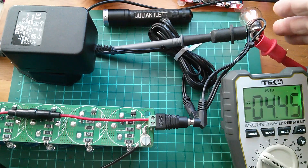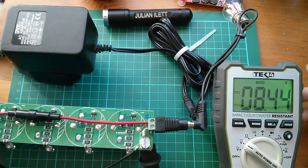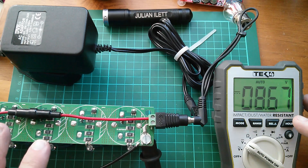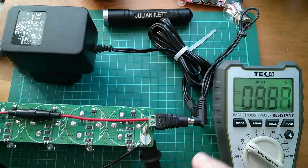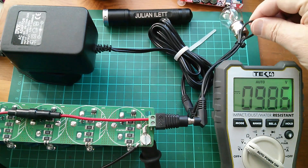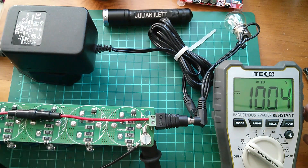After some difficulty attaching my meter probes to the bulb, we can see the bulb voltage is about five volts and falling. So the voltage across the bulb will fall. As that filament cools down, its resistance will get lower, so there'll be a better path for current to flow into the supercapacitors. We're not really overstressing the power supply because it has this resistive load between it and the capacitors. So yeah, that works as a setup to charge the supercapacitors. It's just a bit wasteful - we're losing power in the bulb throughout most of the charging phase. The capacitor bank is approaching 10 volts now and this is taking a long time to get up to 16 volts using this one amp supply.